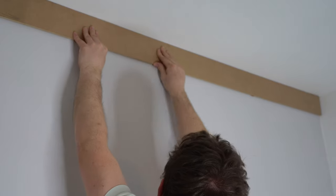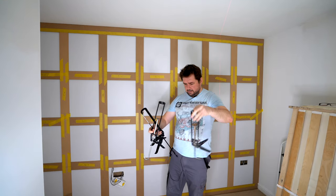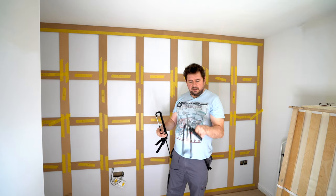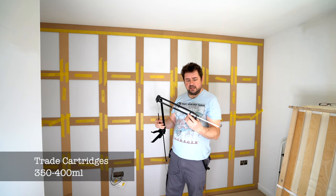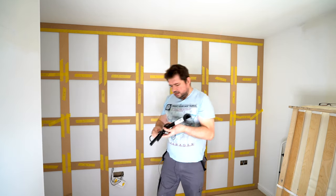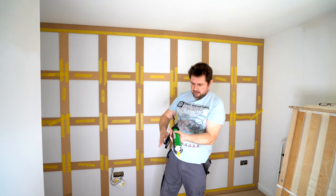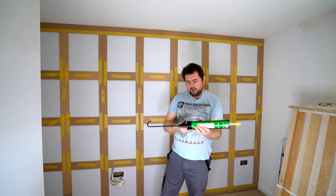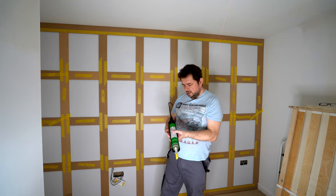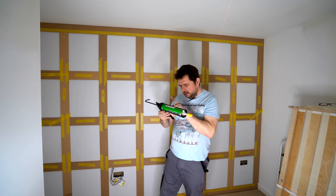As well as those three adhesives, you'll obviously use a cartridge gun for them. This smaller DIY cartridge gun is too small for these cartridges, so you don't want one of those. This other cartridge gun is for the full size trade cartridges, but if you use something like this no-nonsense one — I'll put a link below — you have so much more control on the mechanism. I highly recommend this gun. It's probably about three times as much as some of the other guns you can buy, but still only around 15 to 17 pounds.